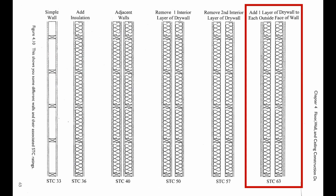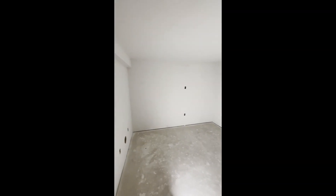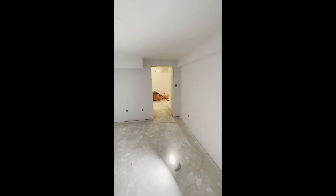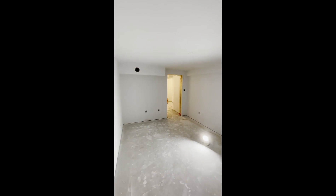This last strategy is the foundation of my design for soundproofing my studio. It's important to note that the goal is to have a consistent strategy around the whole studio in 360 degrees. Any hole in the drywall for things like windows, doors, electrical, and HVAC are weak spots that require careful attention to detail. I've left a link to my full series of studio build videos in the description so you can find out how I've tackled each of these problems.